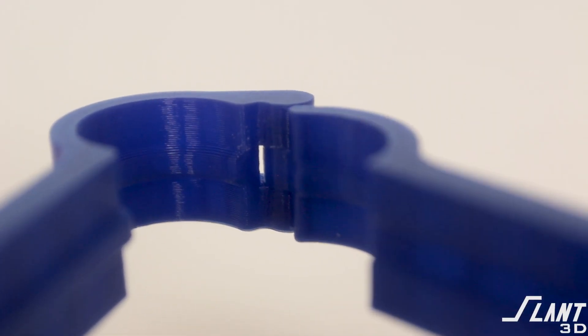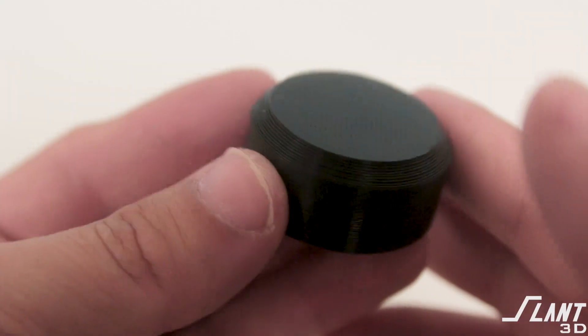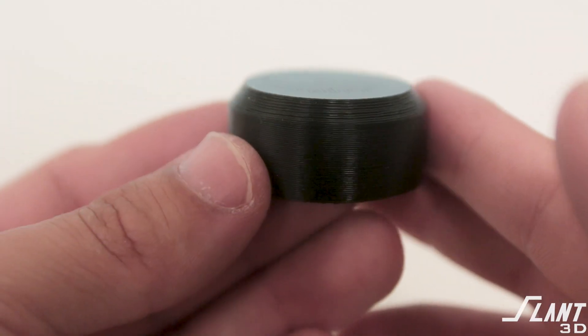As far as the design, it is a very simple device. We chamfer the outer edges to make sure all the surfaces are fine, and it's printed in this orientation so that all the strength is fine. It's printed with PLA because it's an indoor consumer product. The internal hinge itself has a pin that is printed inside of it — which if we were to revisit, we might do something different — but it's never really been a big issue outside of normal product failure life. The spout lid is printed upside down with chamfers on the bottom so the surface always looks really consistent, and you don't have to worry about the first layer deviating.